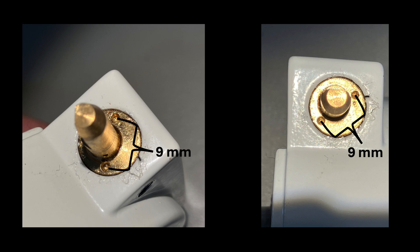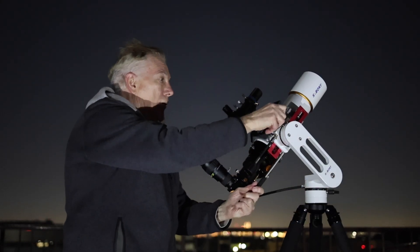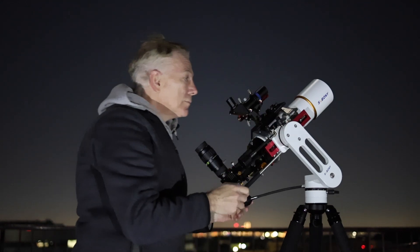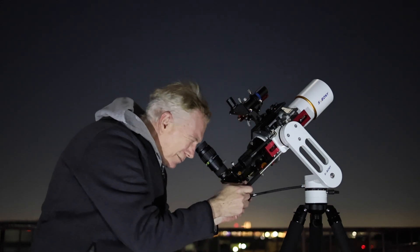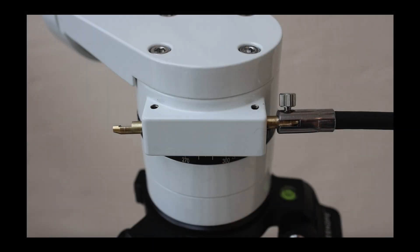This is how you can tune up both the altitude and azimuth gear performance. It essentially is a mechanical tune-up, restoring the mount to original factory performance. The brass worm gear housing is designed to be securely held in place by two allen screws that provide frictional contact from the side direction. These are the two allen screw holes here.